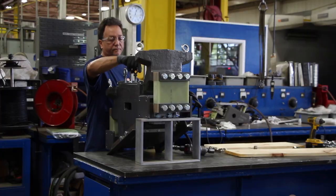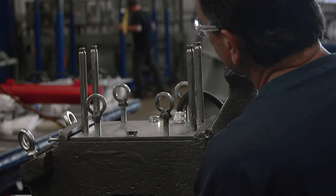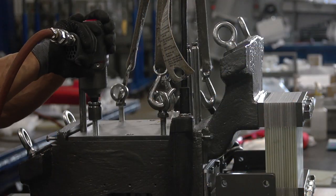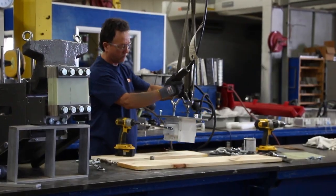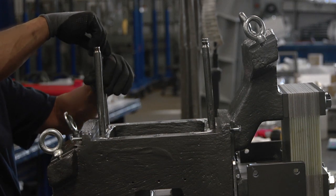Then add eye bolts. Loosen the air gap adjustment bolts and remove the last two bolts holding the assembly. You can now lift the electrical assembly out of the body using the crane. You may need to manipulate the assembly and use a wedge to safely extract it from the feeder assembly. Once it's out and safely set aside, remove the guide posts.